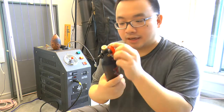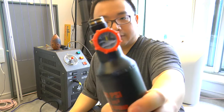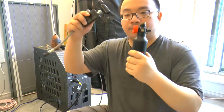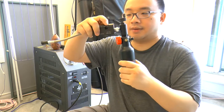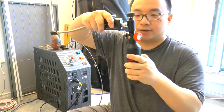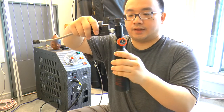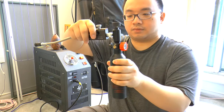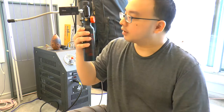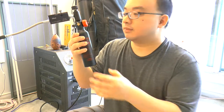So the tank right now is about 2,500 PSI, something like that. I'm going to empty it. I'm going to punch out the air with a fill station device, right here. I'm going to screw that on and it will punch out the air. So I'll just vent the air out, like this. So keep it venting, and we'll dump out all the air almost to the bottom.